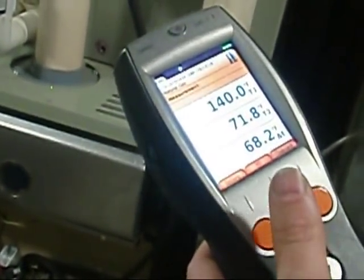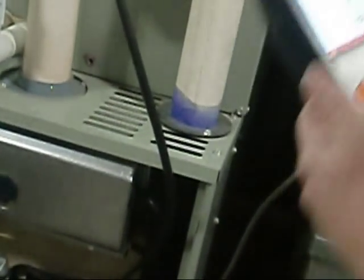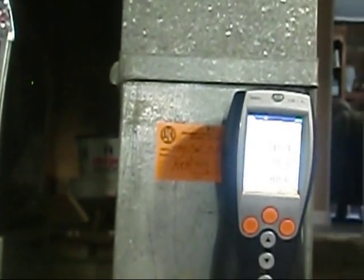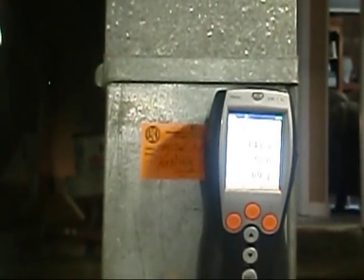We just fired the furnace off, so we'll let it run for a little longer, make sure it balances out. I like that too. Got what, like 3 magnets? Yeah, it's got 3. All right, we got the supply on the top. Supply, return, delta. Okay. So our delta is our actual temperature difference. Right. Temperature rise, yeah. Right now you're running about a 69-degree rise.